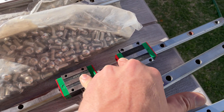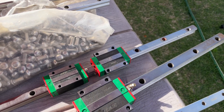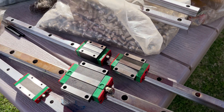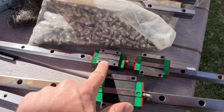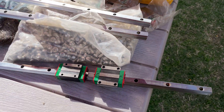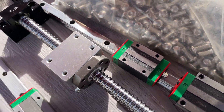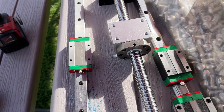The flanged and square high blocks use different screws — with the flanged block you're actually getting a lower profile with a bigger, through-going screw. The square high blocks are more for compaction, for compact situations where you're in close quarters and you may not have a choice. Just consider that when designing your machine.